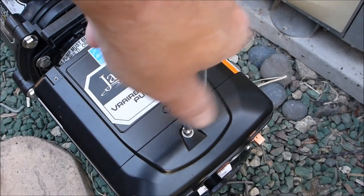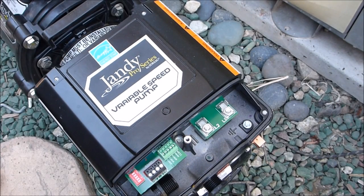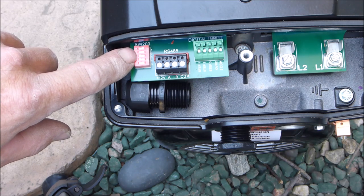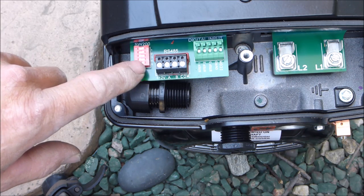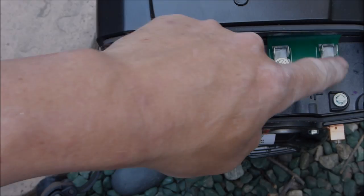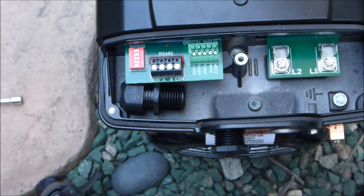Let me remove this so we can wire up the pump. You see these dip switches here on the left — make sure they're set for how you're going to hook up the pump, whether to an Aqualink or to an external controller. I'm going to put the two red load wires here; it doesn't matter which one goes where. And then the green ground wire right here.